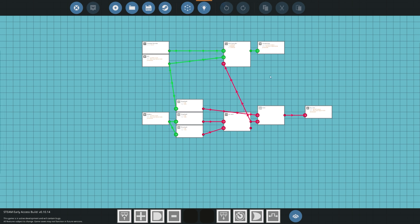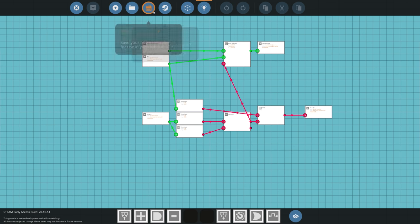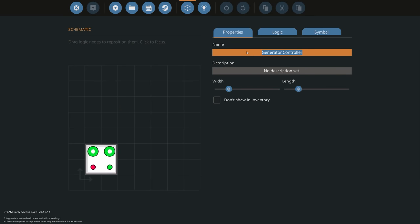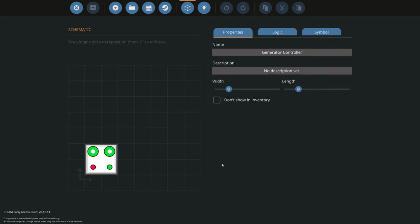The last thing is to add the PID settings. I'll click on the PID and put in some default settings: proportional 0.8, integral 0.005. These settings are quite useful — I've used them in quite a few builds already and they work for pretty much any size engine. Once we've got that in, we can save this microcontroller. I already have it saved, so I'm just going to override it.